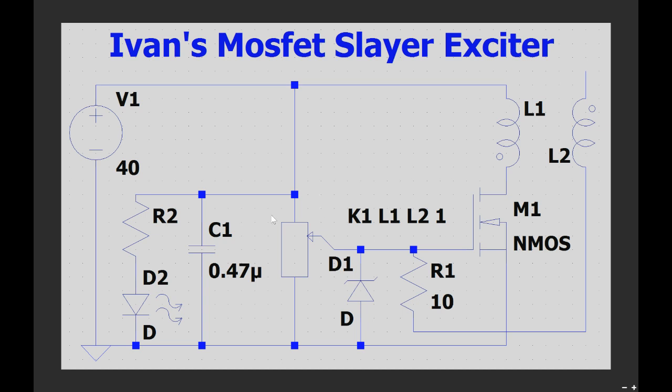Now the potentiometer is here to set the biasing voltage, and not much more. Pretty much any potentiometer within reason should work, although as a general rule higher values are better. Now C1 is the transient smoothing capacitor. I'll be using a 0.47 microfarad plastic capacitor, but any half-decent capacitor with a value above 0.22 microfarads made of polypropylene should work just fine. And last but not least, R2 and D2 — this is just an indicator; they're not really needed for the circuit to operate, but they help greatly in diagnosing power and jumper connection problems, because they illuminate whenever the circuit is on.